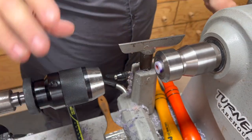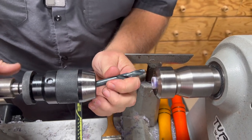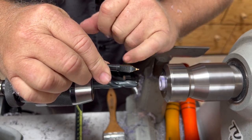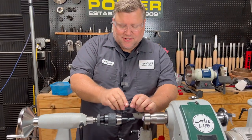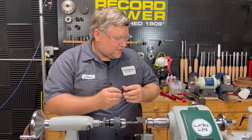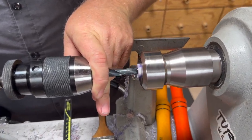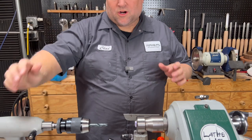And lastly, our three-eighths — this is just that very, very outer rim of the nib. Looking at the nib, that little tiny line on the outside, we just want that to sit down in there. If you want yours to sit on top and have that lip be on the top of the section, you can do that — you wouldn't cut this one. But for this lesson we're going to do it this way. We're just cutting a millimeter and a half and we should be good. So that was our four drill bits.